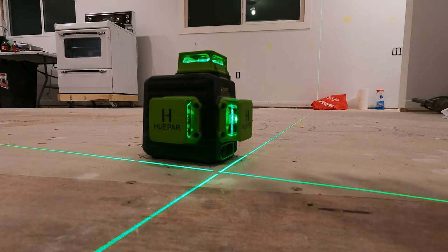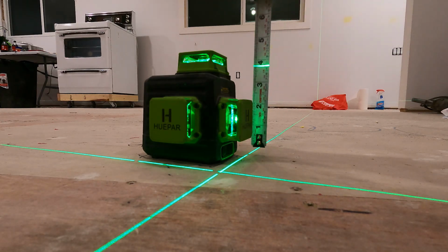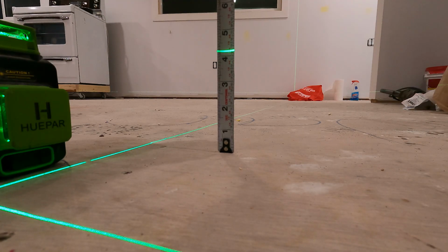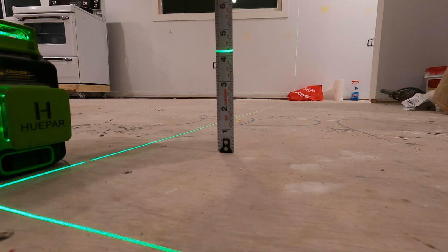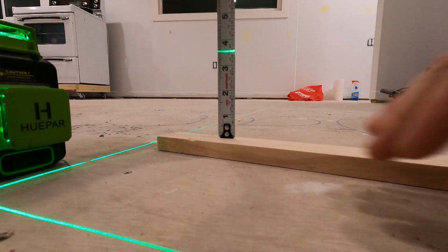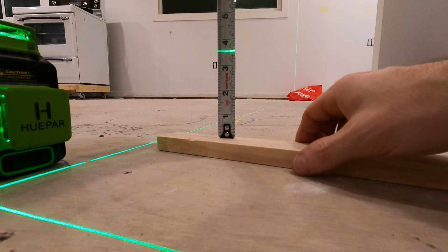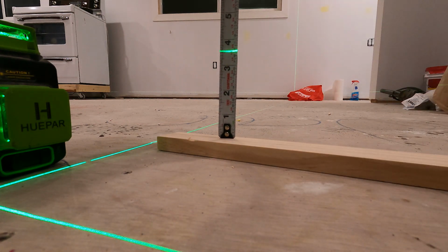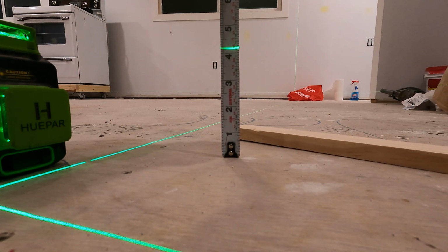Like I said, that 4-inch number is pretty arbitrary, and it's not even exactly where this laser sits relative to its spot on the floor. This is right around 4 3/16 here. Now, if it seems a little counterintuitive as to why, when I say if I choose too small a number, I have to do more grinding, let's put this block in underneath here to simulate the floor getting raised up a bit. And you'll notice that when the floor gets raised up, the number that I read with my laser line gets smaller. So I'm at about 3.5 now, instead of 4 3/16.